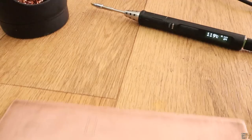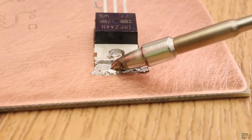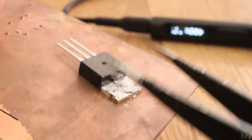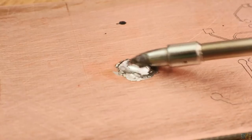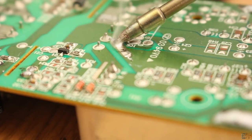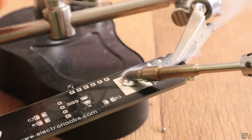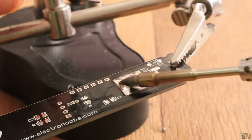The first test and the most difficult is soldering a MOSFET to a copper board. It took some time but it kind of did the job — we definitely need a bit more power for this job. I did another test and it soldered the component to the board, but the solder looks kind of cold. But hey, this is a difficult job even for my soldering station; for an 18W iron it is more than enough. Here I've melted a big solder ball with no problems, so soldering components or filling big tracks must be very easy. I was able to melt a ball of solder on this PCB with no problems and fill the tracks with solder. For only 18W it is more powerful than I expected.